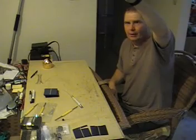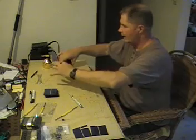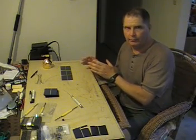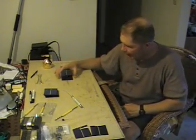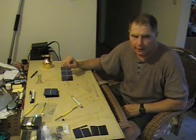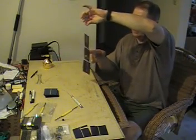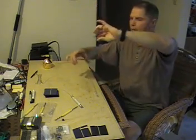Each cell is half a volt. Get 36 solar cells together and you'll have an 18-volt solar panel. These cells are rated at about 1.7 amps. When wiring them in series, it's always positive side to negative side — alternating all the way through.